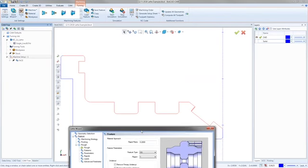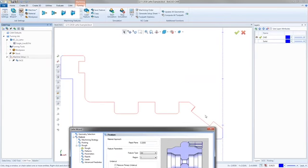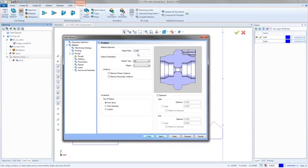Here's the thing, though. We got a lot of grooves on here. I got this big angle groove here, and I don't think I can leave this one out, which I'm okay with it cutting a little bit of this as long as it's not gouging any of my walls. But this turn groove here and then this face groove here, I can actually go in and I can make BobCAD ignore those. That's the reason we're able to pick the geometry the way we were just now.